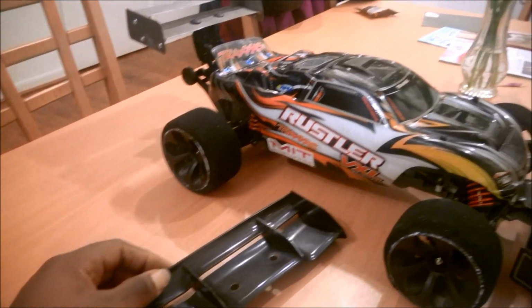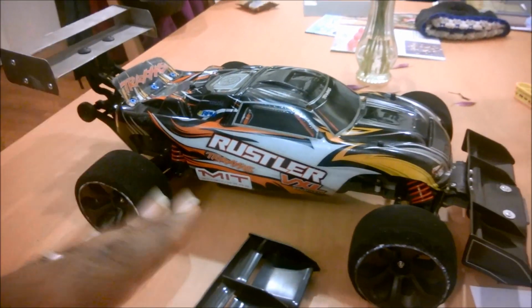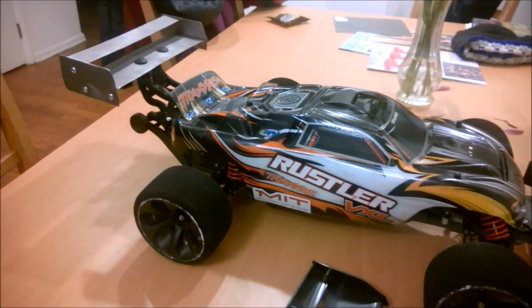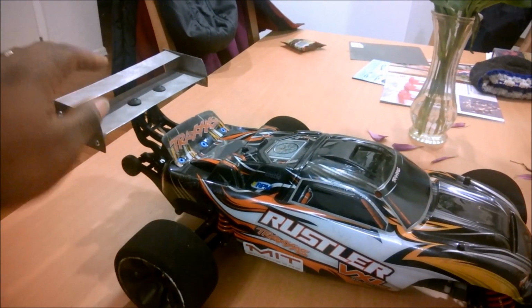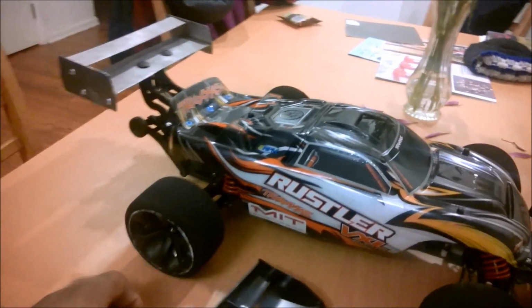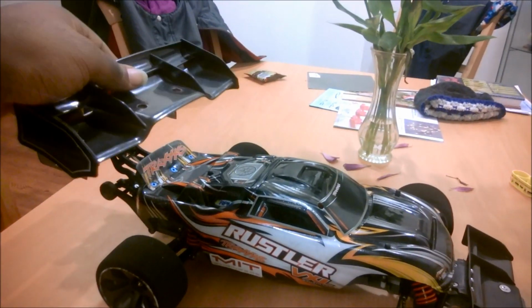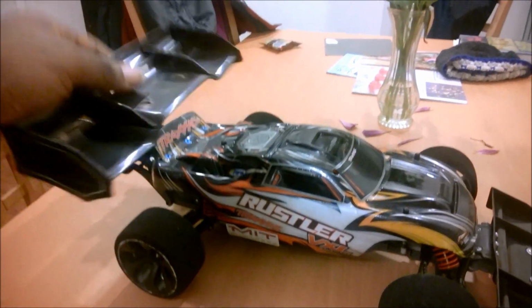And if you saw my spring testing video with Slade, you heard the chatter sound, and what I call flutter. What was going on is the springs were so soft, the rear end would catch the air, dig in, slam, rebound, come back up, start making downforce again, slam down, and go over and over again.